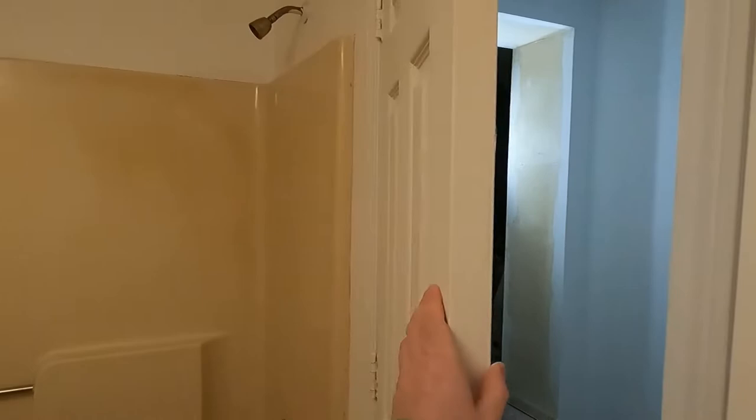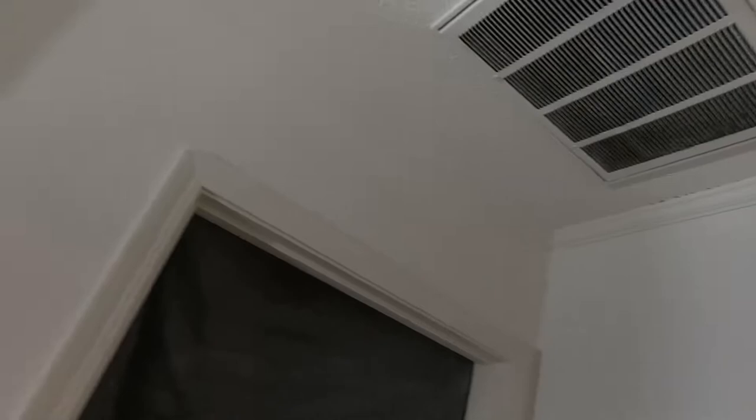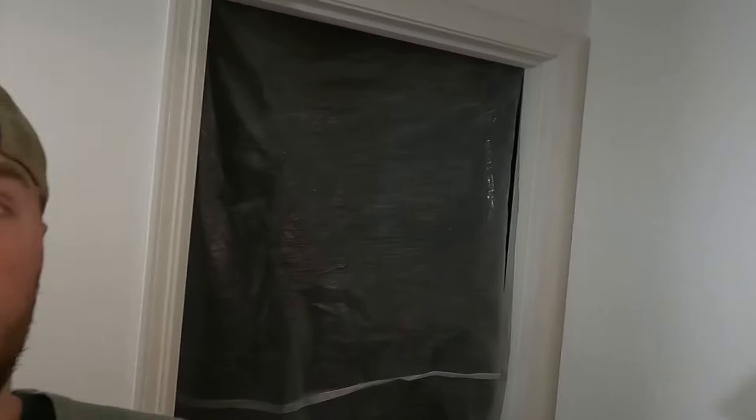This door is primed up and ready to go — two coats of primer on the door, and the trim and door casing all have had two coats of primer. The ceiling has been repaired; you can kind of see where the popcorn was. Keep in mind when you're going over this stuff with a fine-tooth comb, you're going to look at things that people are not normally going to see — and you're not going to be in here inspecting it with two huge LED lights like this. A good rule of thumb: if it looks great under this lighting, normally with just a hall light the defects are not going to be that noticeable.